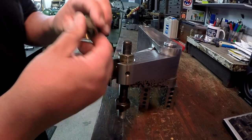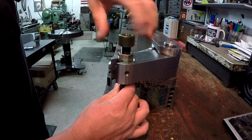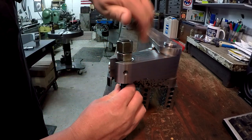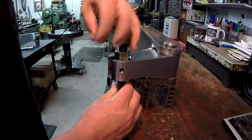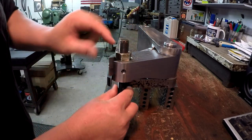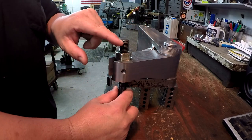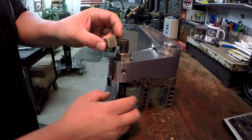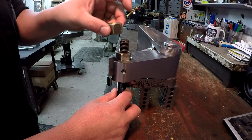This other nut here is just simply a lock nut that will go on top and lock these two together. In addition to that, you have a hole that's drilled here that I'm assuming is going to be for a pin - we can just put a roll pin there. And that is to keep these nuts from backing off at all.